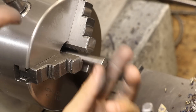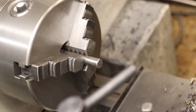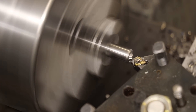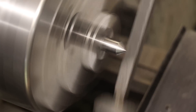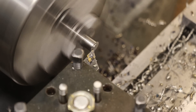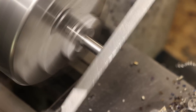The next thing I'll do is turn up the pin. You'll generally want some type of high carbon steel to make the pin, and I have a piece of 10mm W1 tool steel which will do the job just fine. Depending on your lathe and chuck, you may want to swap out your normal chuck for either a four-jaw or a collet chuck — this will help reduce runout and get the centre point directly in the centre of the part. I'm also rounding off the back striking face just to make striking it a little bit easier, so it won't cause issues if I don't strike it dead flat.